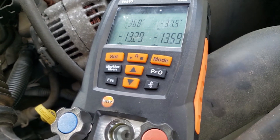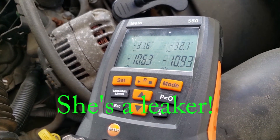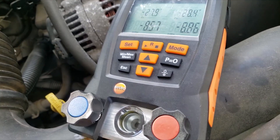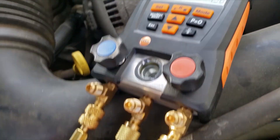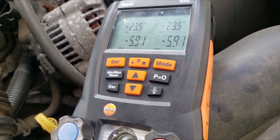I've got these ports closed. She's a leaker — this is sealed off, this center hose is sealed off. And you can see my pressure is going back up. So that's a pretty big leak there. Let's get started and hook up the refrigerant first.